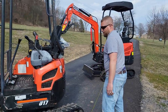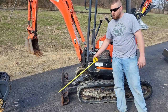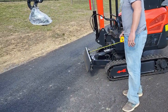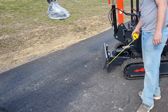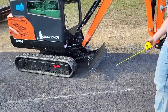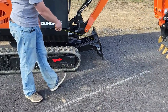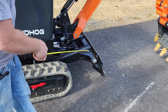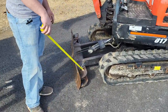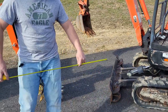If you're looking one to the other, ours has the extra collar around the blade. We have curl protection — look at the Kubota blade: flat steel. The Groundhog blade has curl protection, which gives you extra strength when you're pushing stuff, and then it has edge protection. We figured if Kubota's doing it, why can't we. We have heavy steel on the inside, tube around it, support flanges that come to our wings. The Kubota just has a swing out. Side by side, we have a heavier build.